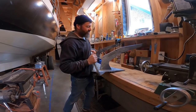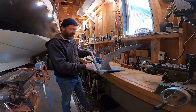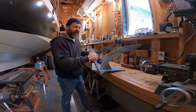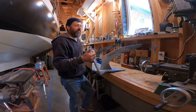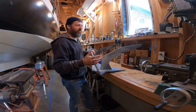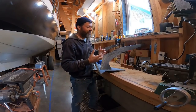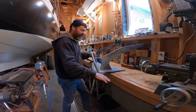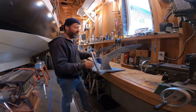In that situation, maybe the turned up flukes would be better, because that would act to block the motion. Might get a higher holding power in that case. That might be the case for a seabed like loose sand. Loose sand is much more like a liquid. There's not nearly as much cohesion. Maybe we want the anchor to dive down and block seabed from moving.